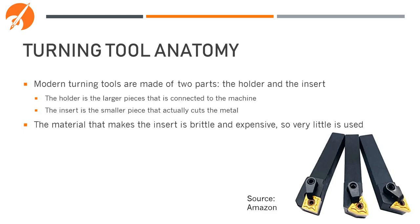You can't make an entire tool out of carbide for turning. That's where composite tooling comes in. In composite tooling, the tool holder is made out of steel, and only the bit that's actually in contact with the material is made out of carbide. The black is all steel for the tool holder, and only the gold is made of carbide. The two are fastened together using a mechanical fastener such as a screw or a clamp. There is also composite tooling where the carbide is brazed onto a piece of steel, and both must be thrown out once the tool is broken.